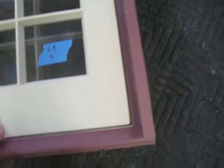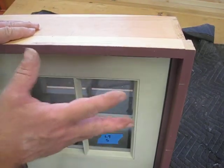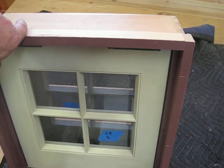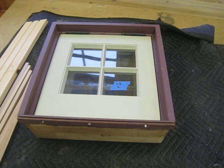From the outside, the storms are sealed in the same manner as the interior, except the bottom does not get any sealing — this allows moisture to escape. All of the hot air and convection of the window is held up top, so it would be like trying to blow air into a bottle; it wouldn't really blow in. There is no real air leakage, it's breathable on the outside, and I think they are pretty high efficiency windows because the wood is not a thermal bridge.